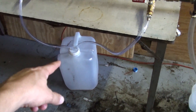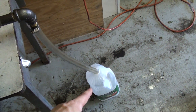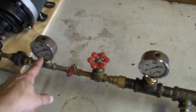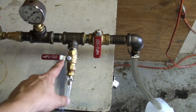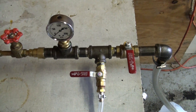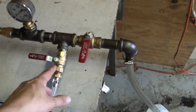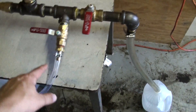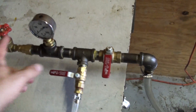After that point we've got a T here — one side goes down below to the same place as the bypass, and the other goes to where we want to make our biodiesel and send it into its final tank. The point of this T is that because the system is so sensitive it has to be adjusted every time. We start with the bypass open, the gate valve all the way open, and this output valve closed. We slowly turn the gate valve until pressure reaches 125 psi, then we open the output valve and close the bypass — and suddenly we're flowing good biodiesel. That way we don't have unreacted biodiesel making its way into the final tank before the pressure is at the right point.